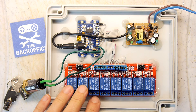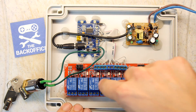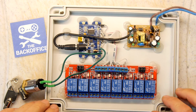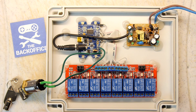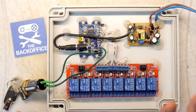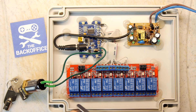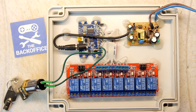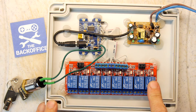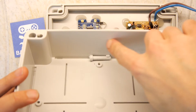They'll all have to be individually fused. The total load I don't want to exceed is 13 amps, so it'll be protected by a 13 amp fuse plugged into the mains. I want to make sure each individual outlet can only draw about five amps, because a general arcade machine is about one and a half to two amps operational, but inrush current when you turn it on could be around four amps. So across eight machines that's potentially 16 amps — pushing it a bit, but I think we'll be fine. The individual fuses are important because you don't want to blow the PCB traces on the relay board. If one cab goes wrong and you've daisy-chained the mains, it could blow out the whole relay board — we don't want that.